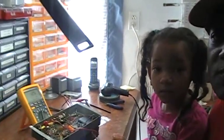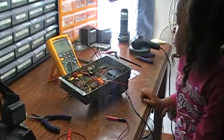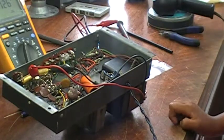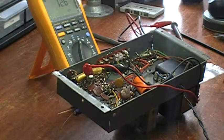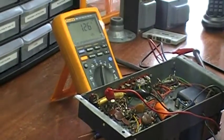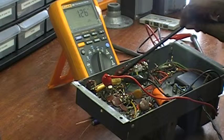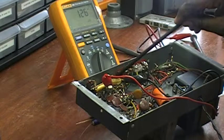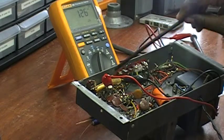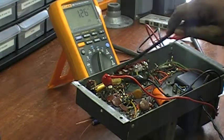Here we go. The amplifier is little? No — it's a special kind of amplifier. It's a reverb amp, not the 122s that we're used to working on. This particular amp, we're looking at the capacitors right here. The Fluke shows 126. A good 100 microfarad capacitor would be less than 110. It's over 110 — it's at 126 — so that means this is bad.